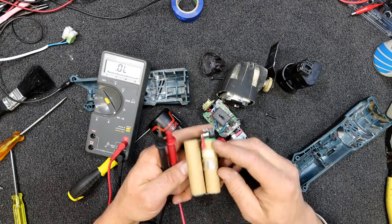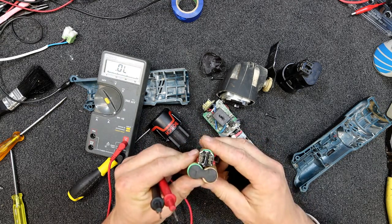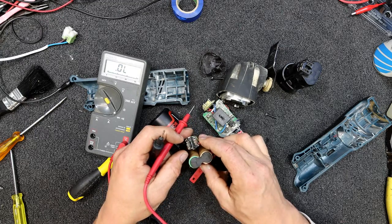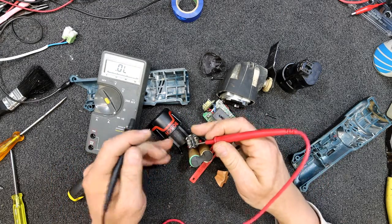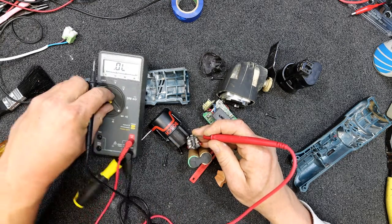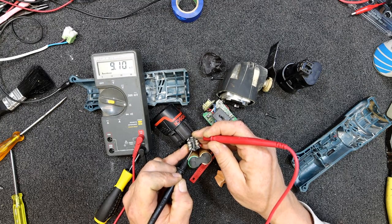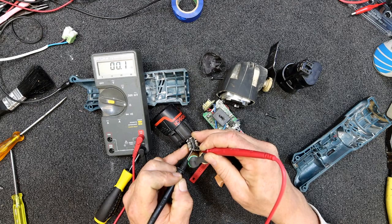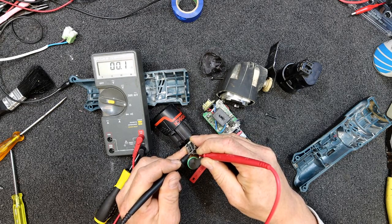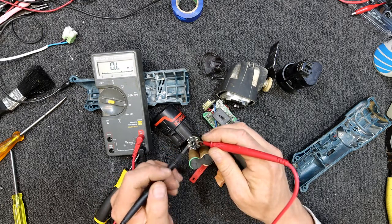Oh yeah, so that red wire goes into that battery, that comes down through that, so they're all in series by the look of it with the welded on bits of metal, and then comes back to there. And then is that connected to that thing? So that terminal goes to the thermistor, comes back up the other black wire here, 9k, so that I assume is connected to that resistor through 0 ohms. Now is that connected to either? That's connected to the other terminal by the look of it, and then that resistor just, I assume, just goes up to this pin. Maybe that's used in the charger somewhere.